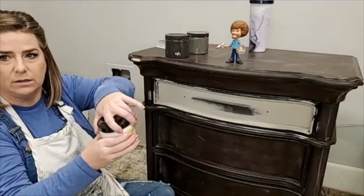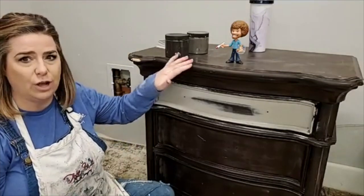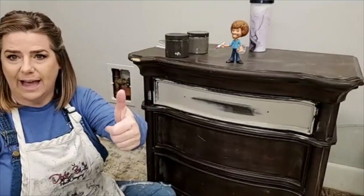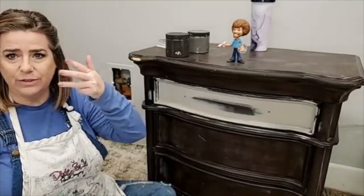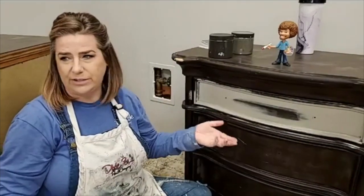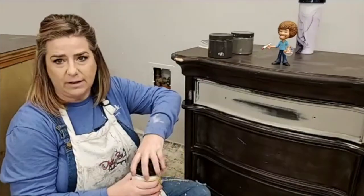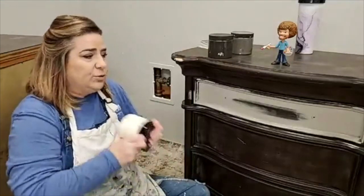I'm painting with my drawers in. I'll take them out and paint around the edges as well, but I want to get it nice and consistent. No, I don't prime first — I scuff sanded and that takes the place of it. These are solid wood. Slick Stick is intended for non-porous surfaces that are not made of wood — glass, plastic, laminate, PVC — those are man-made surfaces. This is real wood with a glossy finish, so as long as I take the gloss down I don't need to prime.